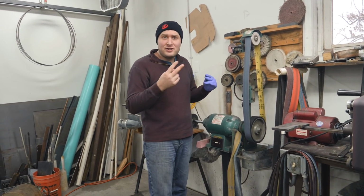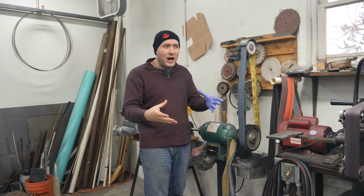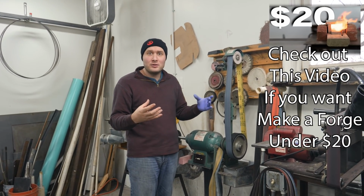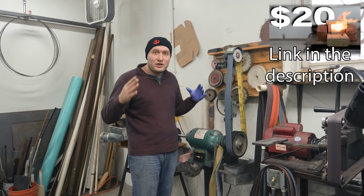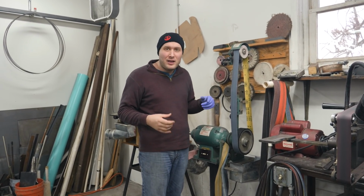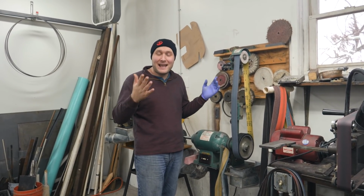The second thing is just some way to heat up your steel. If you want to forge your blade, you're gonna want like a pot and maybe a hair dryer to blow some air into it and some charcoal. I mean, you can start forging just like that. If you don't want to forge, you can jump into it just with a grinder pretty much, and maybe a handheld drill and a drill press, some files, some drill bits, that kind of stuff.